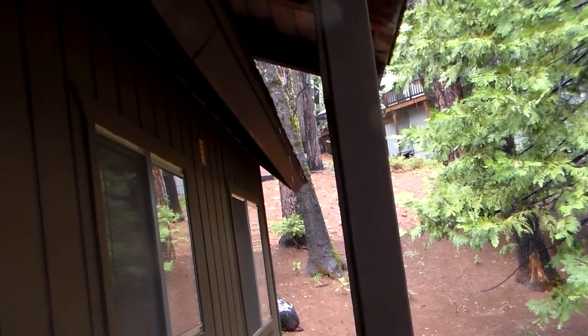So my suggestion on this up here would most likely be that the way the wood is on the ends, there's not a drip edge out there. I would almost suggest that we prime and paint that to match the rest of the house. It would really help, because of the amount of time I would have to prep that to make it look really nice as wood again. I could put it a la carte and let you guys decide, but for us to use a real high-end wood primer would take nothing, and then we would just paint it into the body as if it was just built yesterday. So that would be my opinion on that guy.